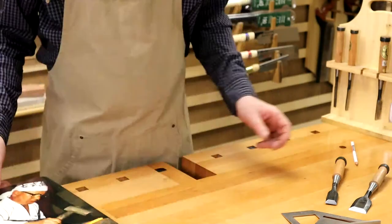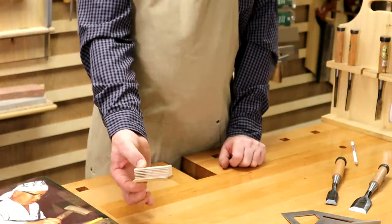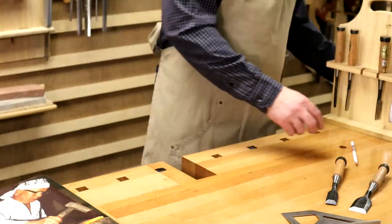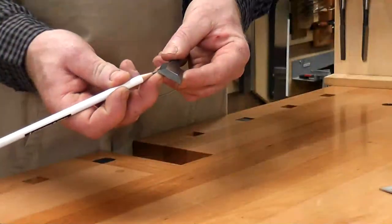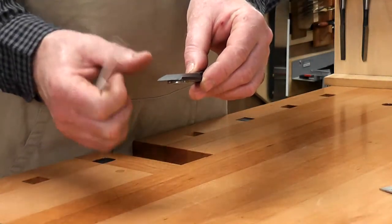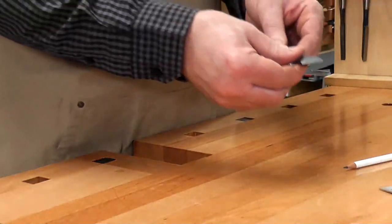So you put your two bits of metal into your forge, you heat them up, you hammer it, you fuse them together. So you actually get that lovely hard metal on the bottom, which is going to do our cutting edge, and softer metal on the top that allows it, if you like, to flex a little bit, give it the strength so it doesn't shatter. That's the first most important bit.